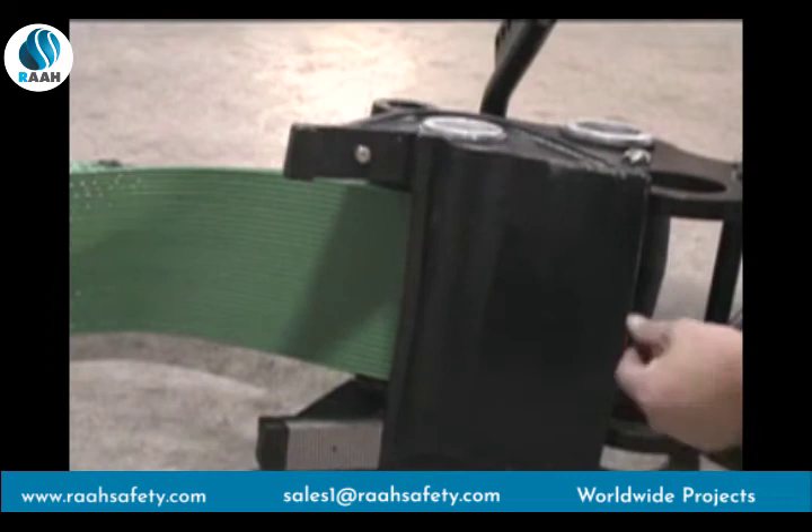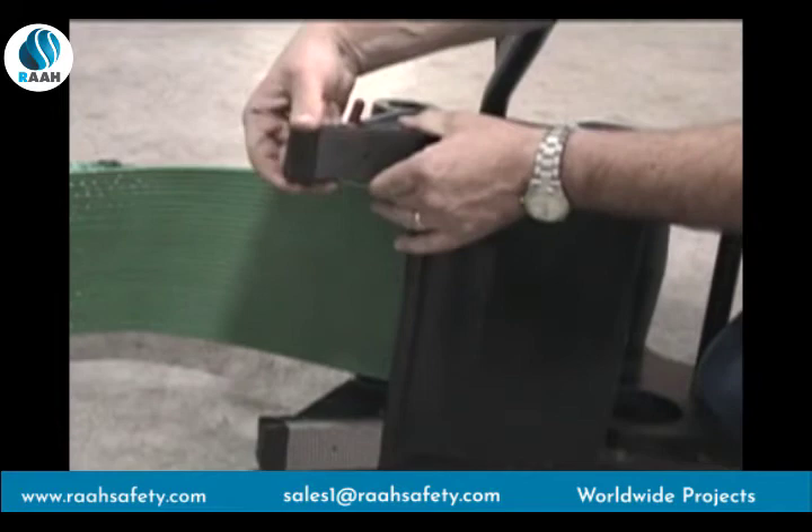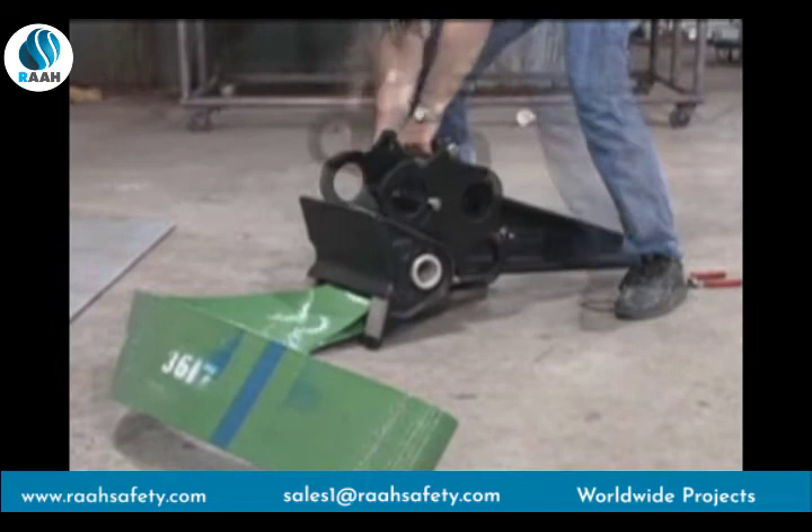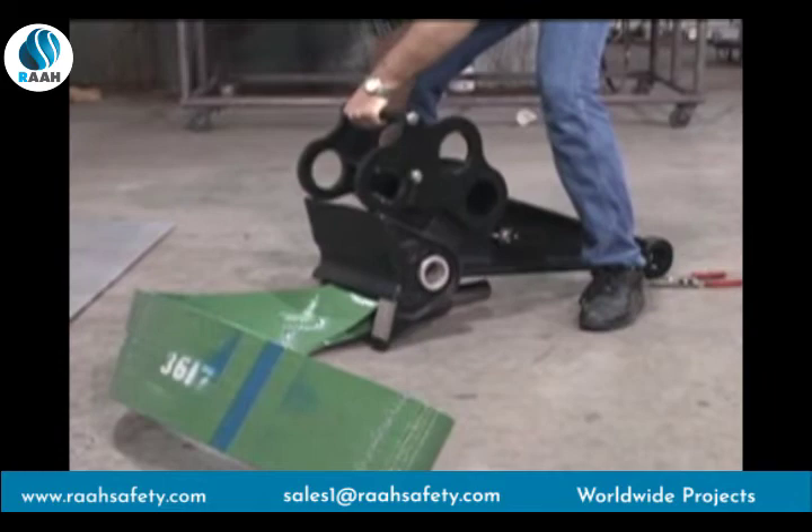The diamond point and blank inserts are quickly changed out. As an added feature, the SCT-1020 and the SCT-2036 tongs can be adjusted to grip the pipe body or pipe upset as needed. Here we're showing the adjustment being made on the SCT-2036 tong.